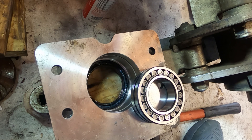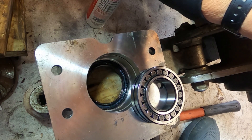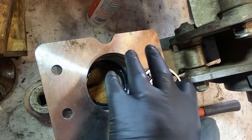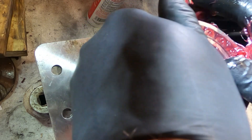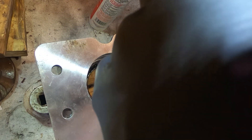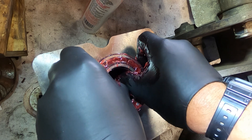Now that we got the bearing unpackaged, it's important that we pack this bearing with some grease so that on startup this thing's ready to go, otherwise you run the risk of ruining your brand new bearing. We want to get grease down in all the races between all the ball bearings, so we're just going to work it in there. Careful this thing doesn't fall apart on you. I just use some red and tacky — it works good. Talking to the guys at Mongo, that's what they recommended.